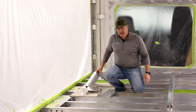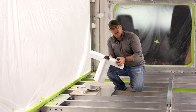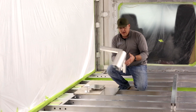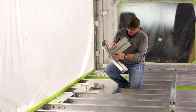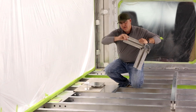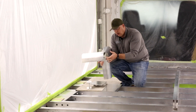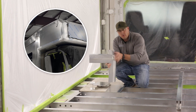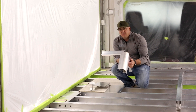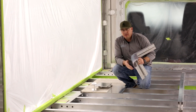Around the whole perimeter — and it is cosmetic for sure, but it's also structural — is the corner radius. This is proprietary to us. I've seen them in PVC, ABS, aluminum screwed on, some glued on. We basically — and this is just the mock-up, tack welded — but this all gets fully welded. This is eighth inch wall aluminum. The walls come in here, the trusses come in here, everything's tied together. The really cool part is on this corner cap: we actually form a piece of metal, fully welded in, metal worked, and body finished all the way out. Everything is welded. The entire seams are welded. All of this coach is fully welded everywhere — every seam is welded. There are no mechanical fasteners visible in any way. It makes for a really strong, really smooth, good-looking finish.